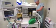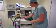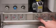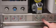Then we're going to come around the front and check the pressures. First we'll look at the pipeline pressures and make sure they're all around 4 bar. Then we're going to look at the cylinder pressures and make sure they're adequate. A full air or oxygen cylinder will hover around 130, so 100 or above is acceptable.